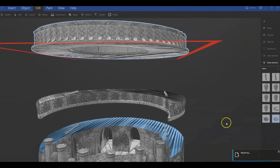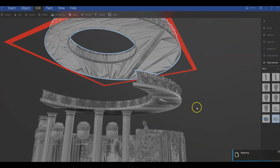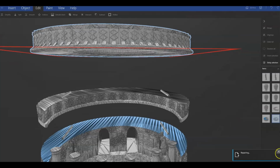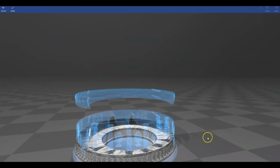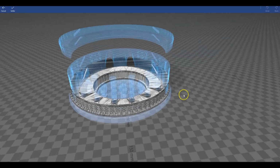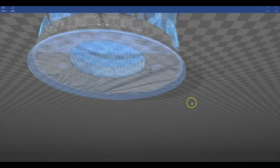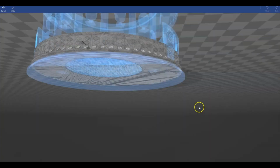Is splitting it more effective than extruding it down? Well, if we go to settle it and it's got odd ridges, then it won't settle flat. Gotcha. So extruding it down would be doing damage. Yeah, kind of. So what we do now is we settle that. Because this was split geometrically that way and that way, we've got a parallel flat on the top and the bottom.